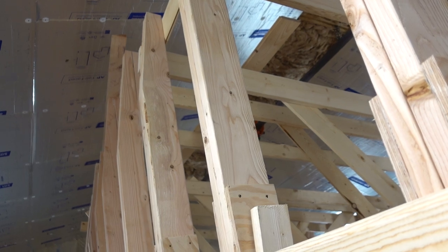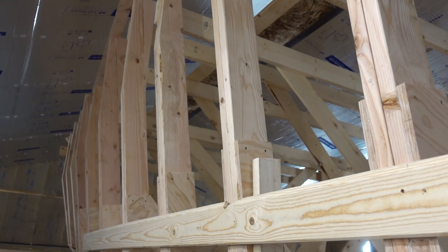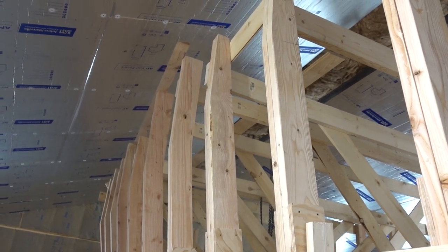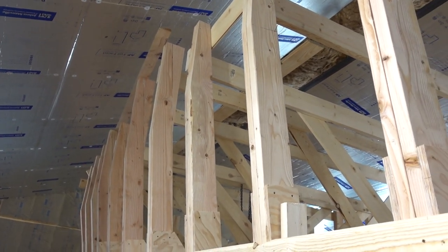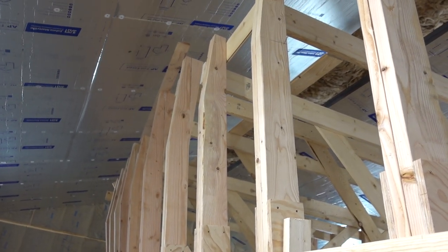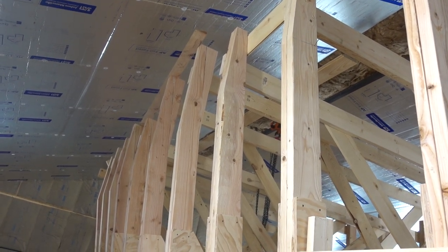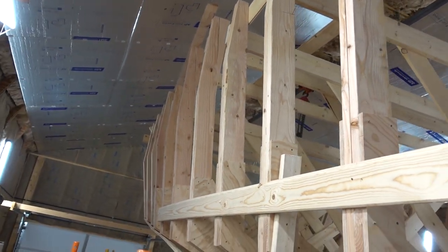The tanks wouldn't fit in there according to the original plans, but George had talked about raising the pilothouse nine inches as an improvement to the 48, and that's what I'm going to do. That also gives me nine more inches in the engine room. Technically a tank would fit under there as-is, but you've got to put supports for the pilothouse in there, which will come down four or five inches, so it would have been snug.